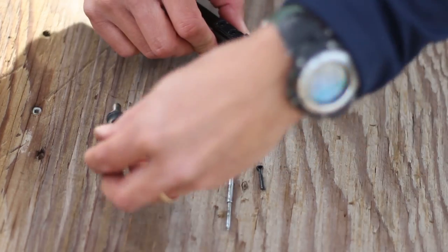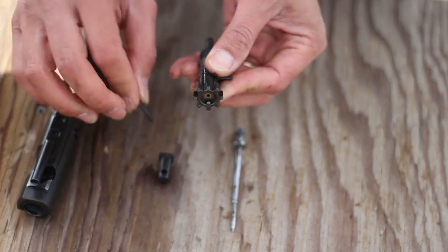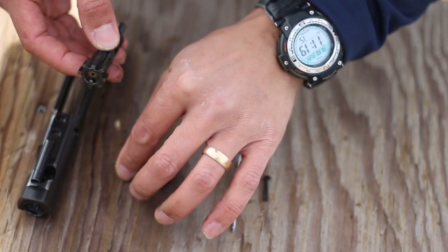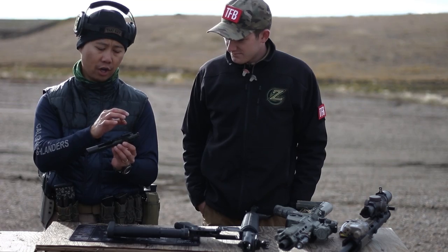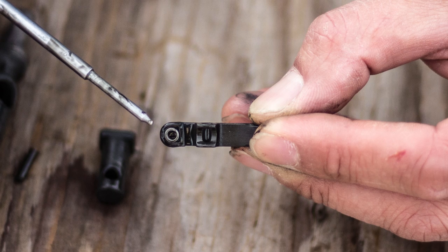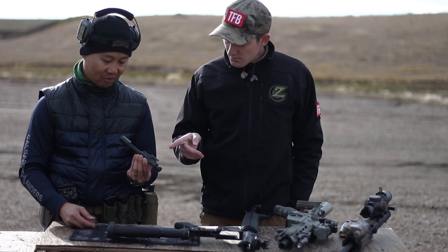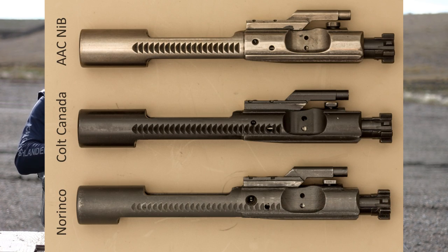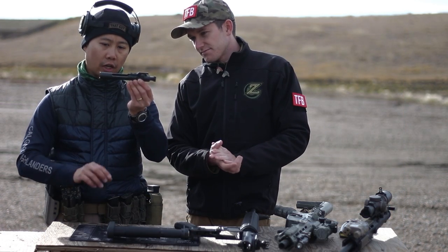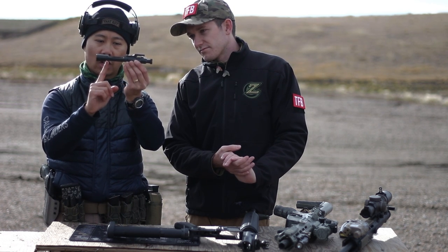This bolt is actually better than the issued one, primarily in the extractor. If you take it apart and look at the extractor spring, there's an enhanced extractor spring with a rubber O-ring in it, whereas the issued extractor spring is just a flat metal spring. What that does is enhance reliability for ejecting rounds when you're shooting. It's also worth noting that on these, they have a pseudo-semi-auto bolt — we don't have the perfect flush. On a full-auto bolt, the cutaways on the back of the carrier are in line, whereas here the bottom part of the bolt is slightly more to the rear.